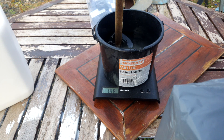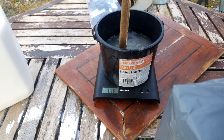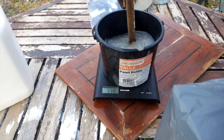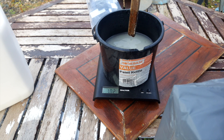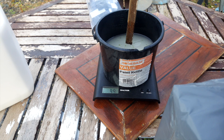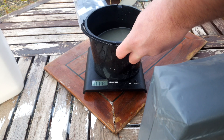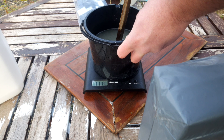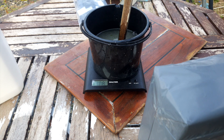I'm adding 500 grams of caustic soda to 1 litre of water. Always make sure that you add caustic soda to the full amount of water, because adding caustic soda to water gives off heat and it can boil. So it's important to make sure the container you're using can stand up to the heat. Adding caustic soda slowly and allowing it to dissolve completely will help you control the heat being created. Make sure you continually stir, otherwise the caustic soda becomes a large hard mass on the bottom of your container which takes a long time to dissolve.